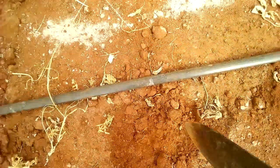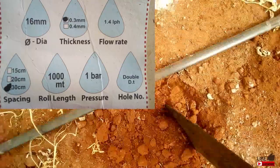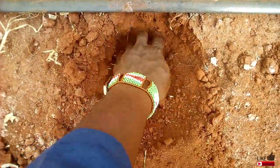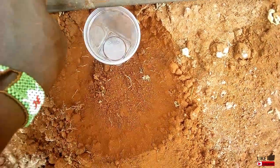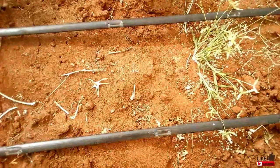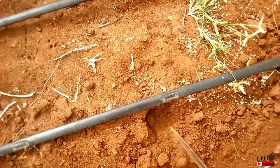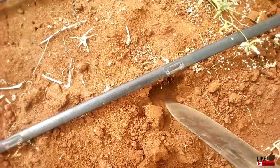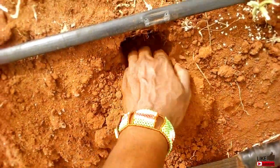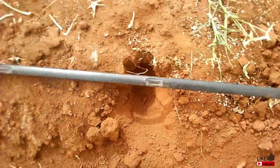The second measurement I will be taking is knowing my emitter flow rate — is it the same as the one advertised by the manufacturer? I doubt it, as the parameters are different here. This process involves setting up containers under the emitters and measuring the volume collected in a minute. The more the samples, the better the estimate. I know not every farmer will do this, but it doesn't hurt to know. This information will start making sense when we talk about crop water requirements and scheduling an irrigation system. Farming is one profession where you can't always trust marketers — always looking for better methods and facts.